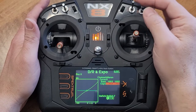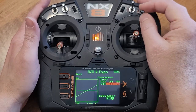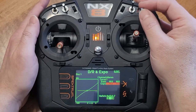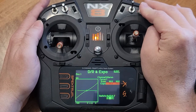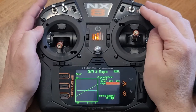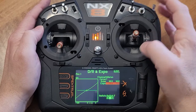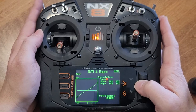So now if you go through it, I got 100, 90, and 70. I like that because I usually fly on, let's say, 90. And if I want to do some tricks and get a little more creative, I can go up to 100. And then if I'm coming in for landing or panicked a little bit, I can drop it back to 70. And things aren't so drastic when I move the sticks. Now, notice I only did the ailerons here on the screen. You have to also do all the control surfaces.